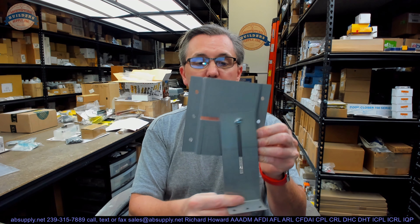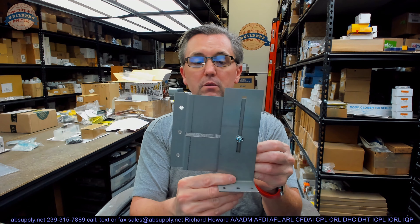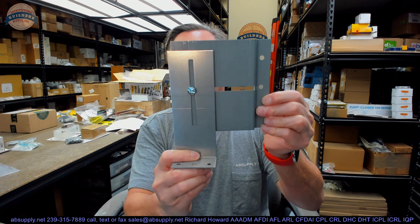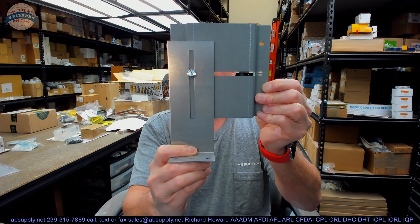The FR668A — that is a fresh take on this. I have never needed to use an adjustable floor anchor that was adjustable in both axes — your Y and now your X. But I can certainly fathom where you would use this. You have not only an uneven floor, but now you have a floor where the X axis is not level and your Z — your depth — is stepped, or there is some completely awful situation that you are trying to set a frame into. Where you literally need to take that and move it all the way over here and then drop it down to this area. That is where you are going to end up using this.